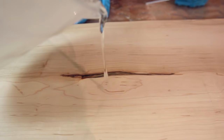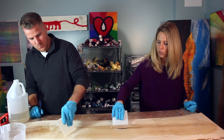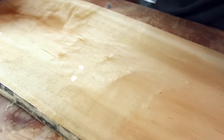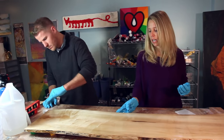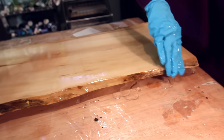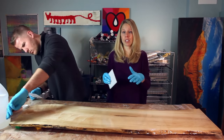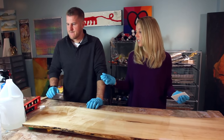Pour it as you see fit — pull it out to the edge, little by little. You have about 45 minutes to do this before it starts to cure, so plenty of time to play around. I just love how it really makes the grain pop, almost instantly. Let's take our gloved hands and just run it along the edge to get a nice super thin layer all along the live edge — just enough to make it nice and shiny. Sometimes with wood you can run into some bubbling issues because this is a live piece of nature, so it can off-gas into the resin. We're going to use a torch to take out almost all the bubbles we see here.